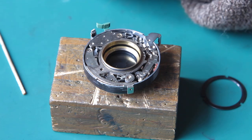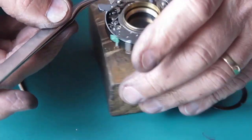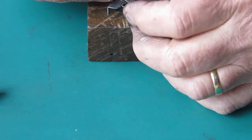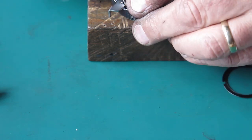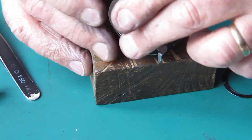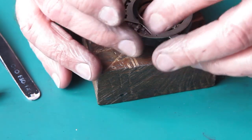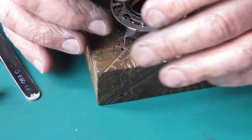What else has to go in here? It's this little piece. This little piece's job is to stop you from being able to depress the shutter release if the shutter is not actually cocked, which can save you film. Put the plate back in place. For good measure I'll put the retainer ring on the front to hold it while I put the shutter in the outer case.